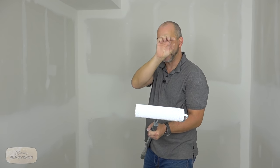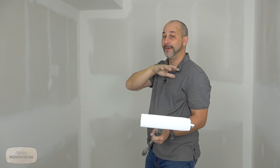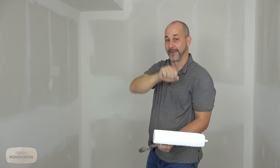Generally, when I'm painting a ceiling, if I have a window that's facing south, then I wanna make sure, if the sun's pouring through a window, that I'm finishing the paint in the same direction as the sun. So if there are any little lines or ridges, even on the microscopic level, sun pouring across the ceiling will highlight it with a shadow.